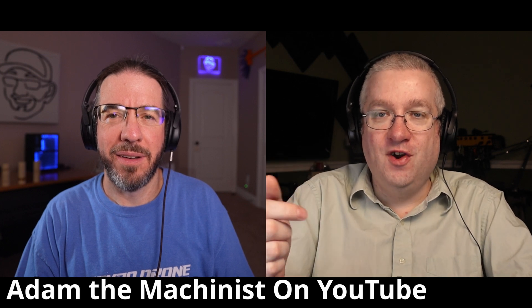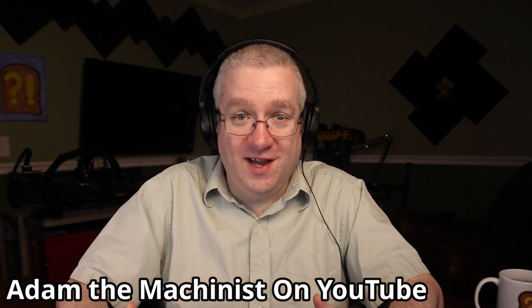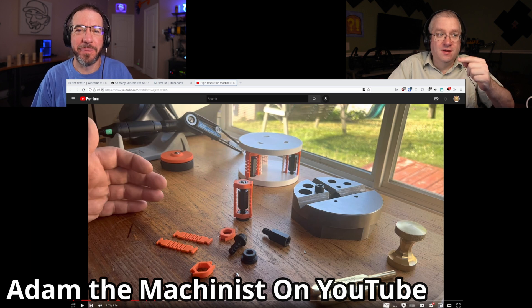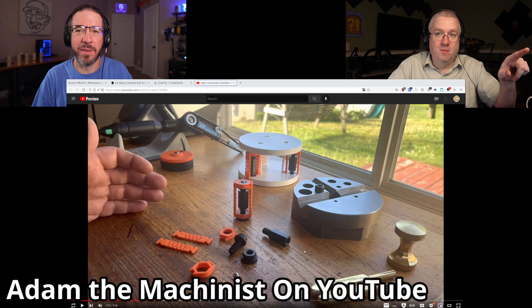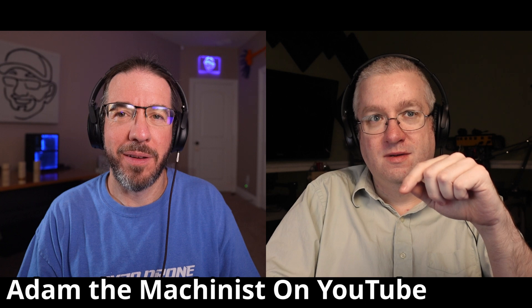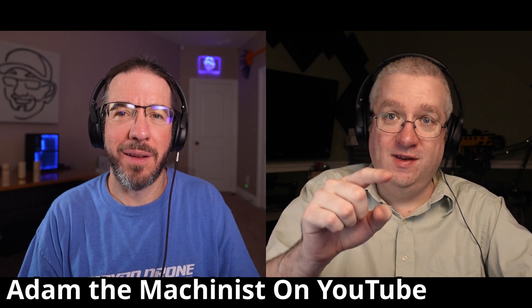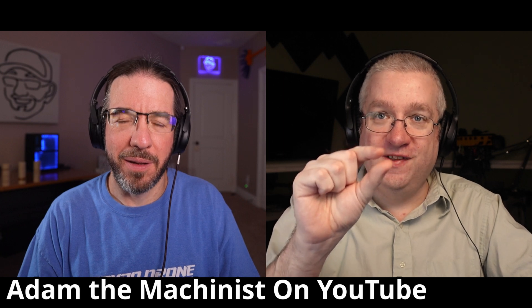But he needs something very precise where one full turn only goes up like two millimeters, and there's not a lot of precision in it. I thought this was fantastic — maybe because I'm not a machinist. Do you see it there, Toby? He has two threaded parts. The top thread is metric and the other one is American, so they don't match. When you turn it one way, the American tightens and the metric loosens, and the other way around. So one is always chasing the other — one full rotation doesn't give you a full turn of the screw; it gives you the difference between the top screw and the bottom screw, and the difference is very tiny.